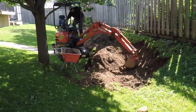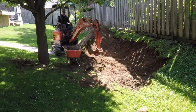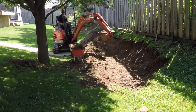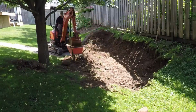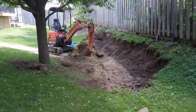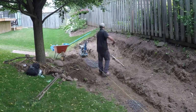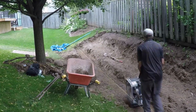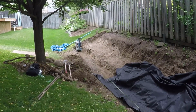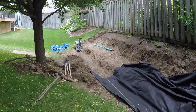After that, it's just a matter of stacking stones on top of one another, ensuring that you're keeping that stagger of course, and then checking every once in a while just to ensure that you're keeping that level, because there could be some discrepancies from wall block to wall block, just depends on how it's produced. But it's that initial course that sets everything up for success afterwards. It takes a little bit of time, it takes a little bit of skill, but we're gonna run through everything that you need to know with that initial course of your retaining wall.